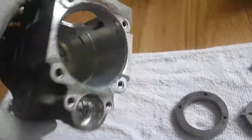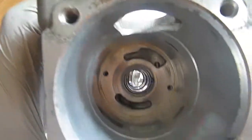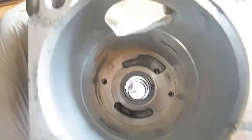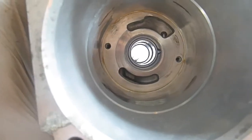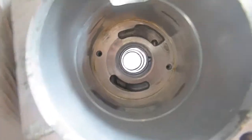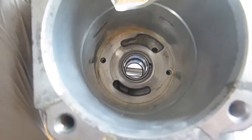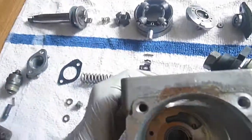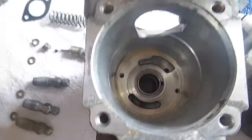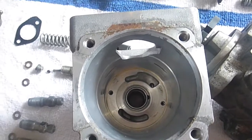The actual body of the pump — it was full of tar at the bottom, as you would imagine. Once you clean it up, it shouldn't have any rust in there, and there shouldn't be any scoring near the upper areas. There is some scoring on this pump — it has scoring in four points. Those four points aren't that essential for the proper functioning of the pump. I know mechanical people are probably screaming, but there is an acceptable amount.